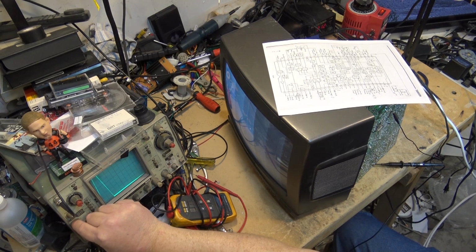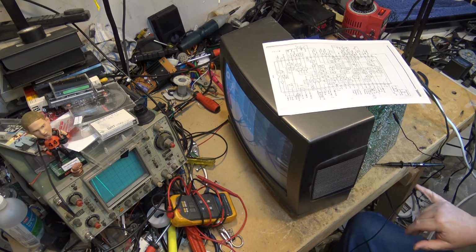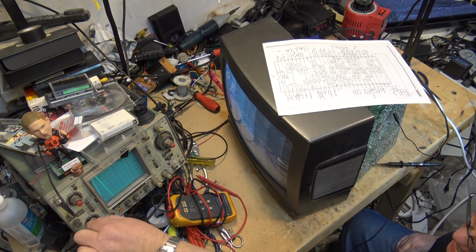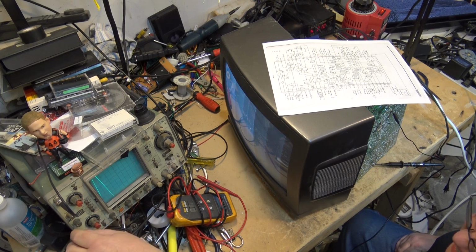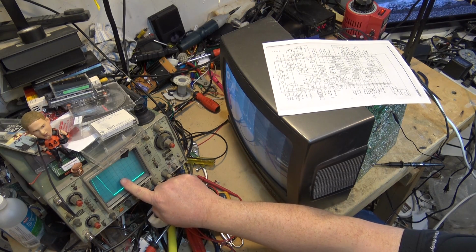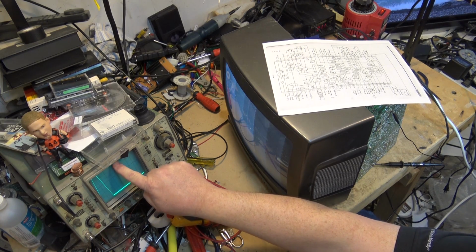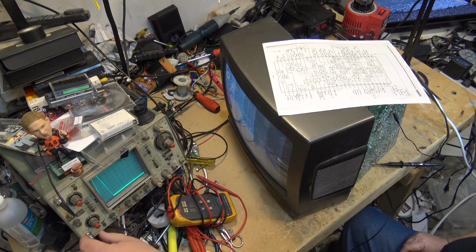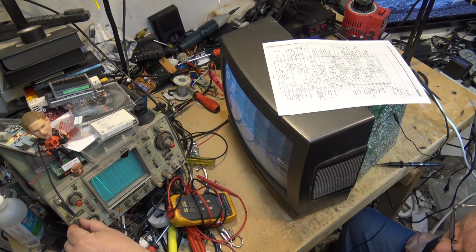Okay, look at the voltage that we've got on this. Now, I want a ×10 probe. This is 10 volts times 10, so each division on this is 100 volts. Here's our baseline: 100, 200, 300, 400, 500, 600, 700, 800. We're off the end of the scale. 900 volts peak to peak. There's our peak right there. Right? And we're about 1,000 volts here.